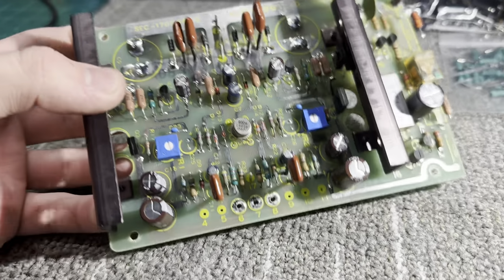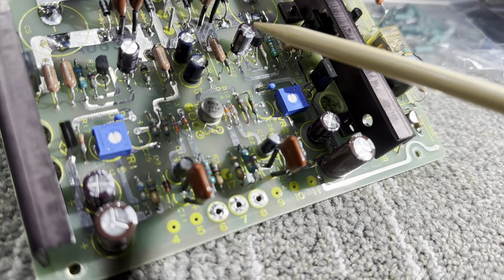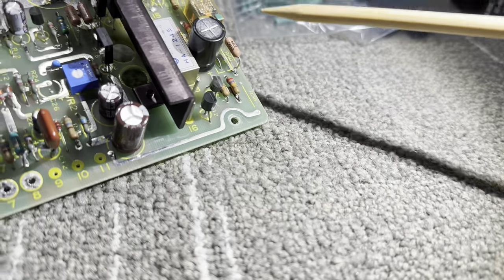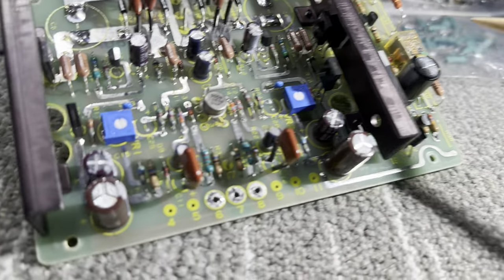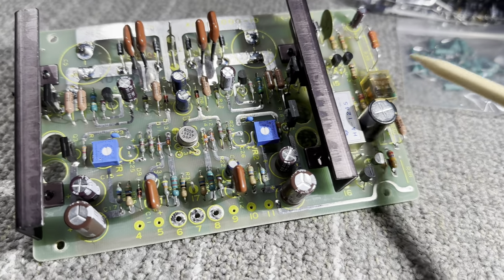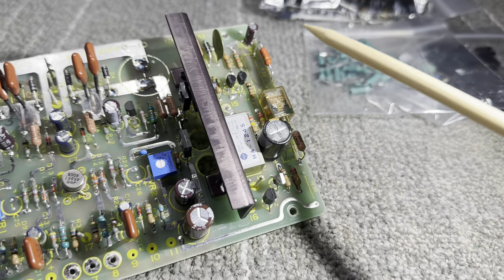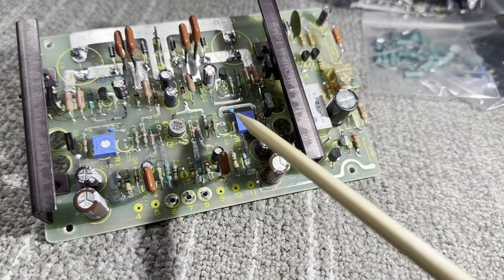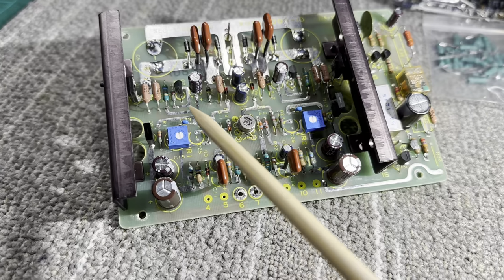But anyway, this thing got all new electrolytic capacitors all around. I used Nichicon UPW and Panasonic FC, as well as I think Nichicon Muse, maybe one or two others. New Dale CMF resistors and high wattage flameproof resistor right here. What else? New trimmers for the positive and negative rails. New C0G ceramic capacitors for the Black Flag replacements.